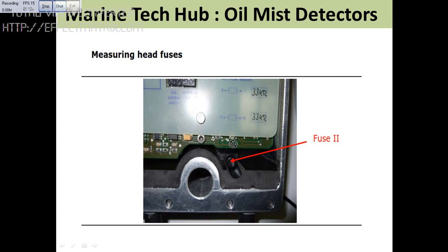For the electrical officer: make sure there are two fuses here — make sure you have spare fuses. And one more thing is the resistance — there are two resistances here. Check that you have spare resistances with you, in order to make sure that the oil mist detector can keep working if the fuse or the resistance goes off. Please have spares with you.